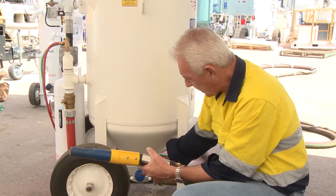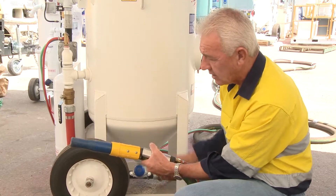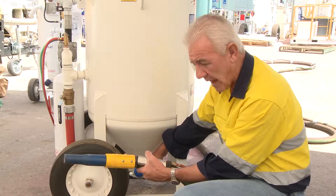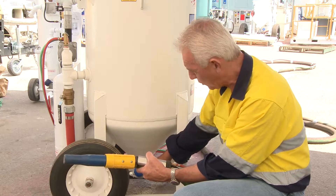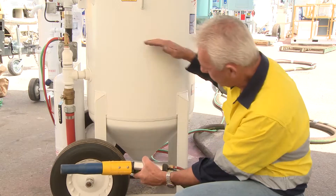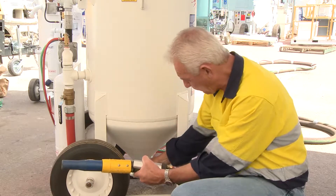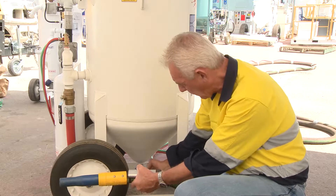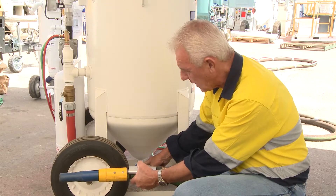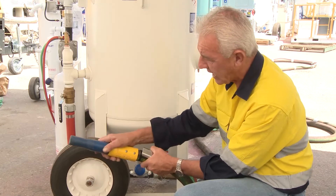So it pays never to open that valve all the way up. If you find yourself opening that valve, there's something wrong somewhere in the system — you must have excessive moisture. Nine times out of ten, it's because there is no after-cooler or air prep in the line to remove excessive moisture. Moisture contributes to how far you have to open this valve to get the appropriate amount of grit to flow through, because moisture tends to coagulate the abrasive and stops its free flow into that valve. All we're looking for is free flow of grit into this valve — don't open the valve too far, and you'll always have the appropriate amount of grit in relation to the air coming out of the end of the nozzle.